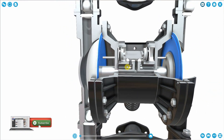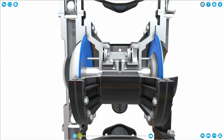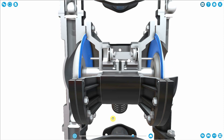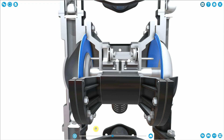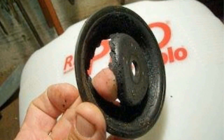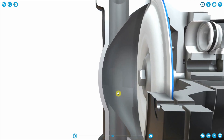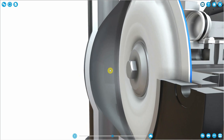We've got two diaphragms in our diaphragm pump, one on the left and one on the right. The diaphragms move from left to right or right to left — they're flexed either outwards away from the center of the pump or inwards towards the center. The diaphragms themselves are manufactured from a relatively soft material, which allows them to flex. Although if we over-flex the material it may rip and then we'll need to replace it. This also happens when diaphragms become quite old — they sometimes get quite brittle, and when put back into service they'll operate for a little bit and then you'll get a tear, which means the diaphragm can no longer pump any fluid.